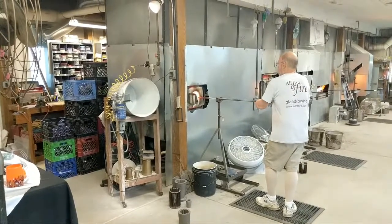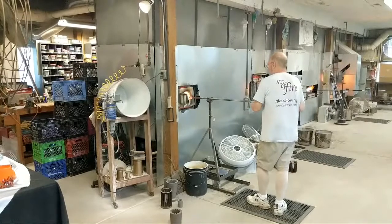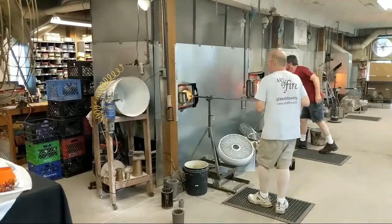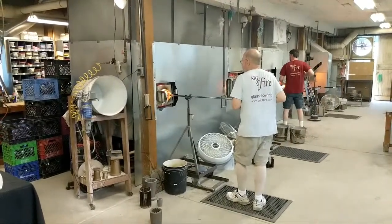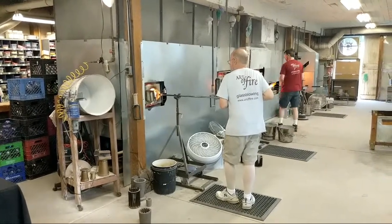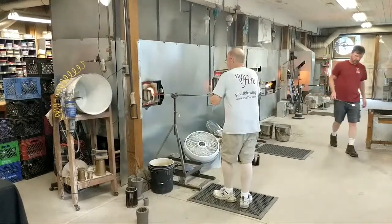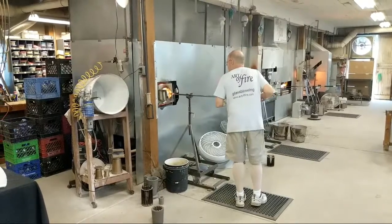Right now what he's doing is opening the diameter of the throat of this vessel, but look at the color darken — the color is darkening where the metal blades are touching the glass. They suck the heat right out of it. He's been back here probably 20, maybe 30 seconds, and he's worked it and we're coming back to the aqua color, so it's time for a reheat. He's going to get that lip flared out a little bit more, and then they'll go through the process of forming the spout.